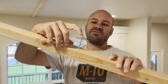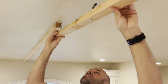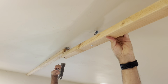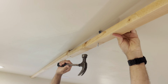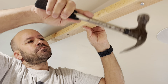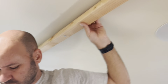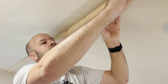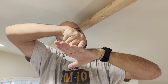Put the toggles through with about a half inch of bolt showing past the toggle. Then line them up — you've got to do one end at a time. Just go one at a time down the line so they stay lined up. This is because we don't have ceiling joists to screw into; these just grip the drywall. You can hear a little click when you push it in — that means the toggles have opened up on the back side of the drywall and are now holding.